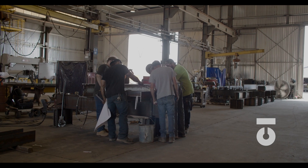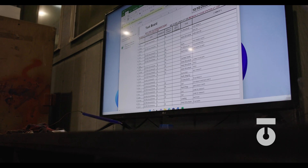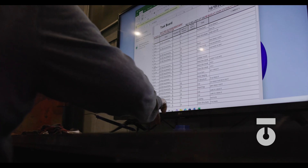Once bills of materials are calculated, finalized, and nested, material is purchased for the project. Then, as shop drawings are approved for fabrication use, we need to have our handover meeting where drawings are released to the shop and the plan for sequencing — the steps to fabricating assemblies and parts in the correct order — is communicated appropriately with our teams in the shop for that job. Tasks are delegated appropriately in the shop, and with that we have our green light.